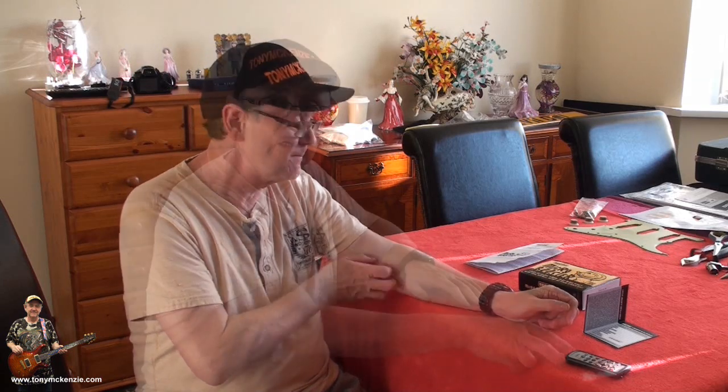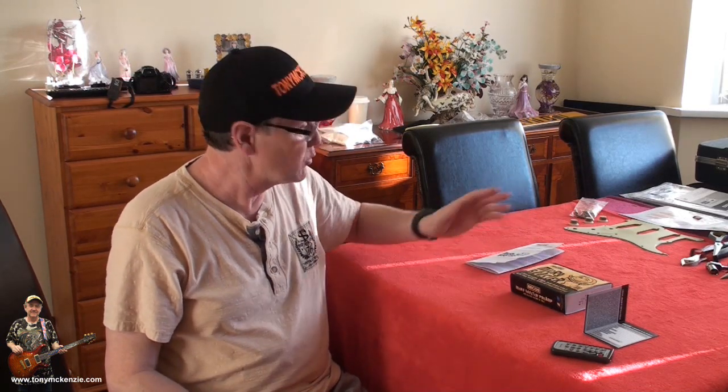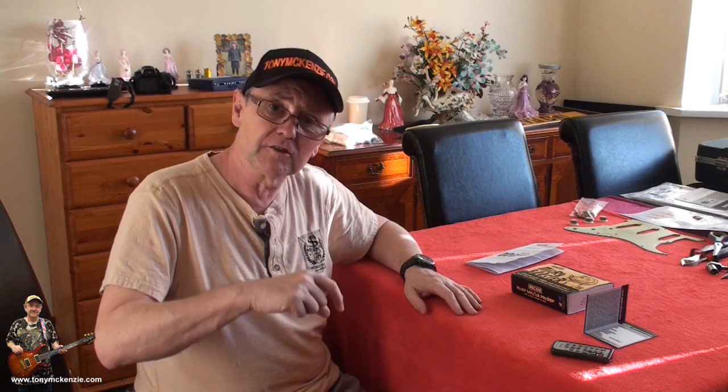So nothing major. I'd also say that if you're not any good at soldering, don't attempt it. You could wreck a load of stuff and take it to the dealer and he'll charge you to put it right. As long as you can solder and you can follow simple diagrams, you probably will be okay. But one more thing: if you try and fit the booster on the bottom tone knob, the one furthest away on a Strat, you're going to have to cut some wood out. Most guys don't want to do that, I guess. So I fitted it on the middle one, and they do say you can fit it on the volume one as well, although I didn't try that.